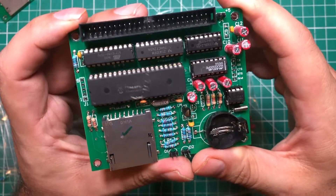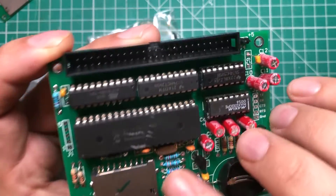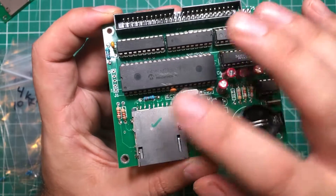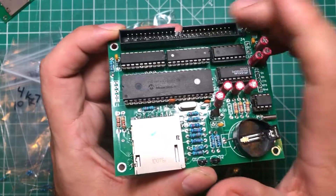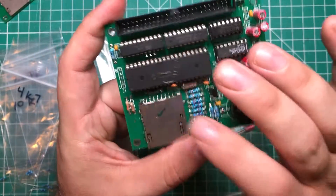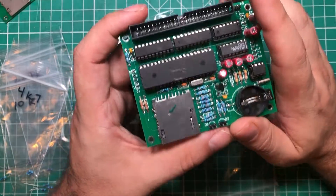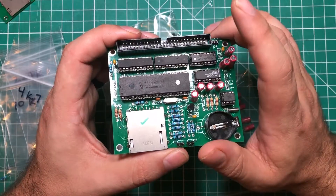When it comes down to it, soldering these things is not very complicated. Every once in a while I leave a resistor a little cattywampus. The trickiest part by far is soldering the SD card. I've done some micro SD cards since these and I've started drag soldering them — putting some flux down and dragging across to solder them more quickly. I'll demonstrate that in another video. I like to use silver-bearing solder on these; it's a little stronger and seems to hold up well for inserting SD cards.